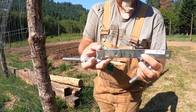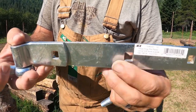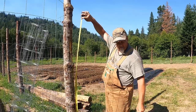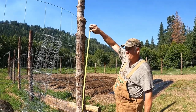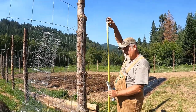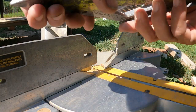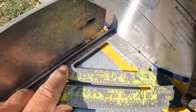The hinge has square holes for carriage bolts so we're going to bolt it through the wood. This fencing is six and a half foot tall — I want the gate to be pretty close to the ground and the same height, so I'm going to go six and a half foot tall. I'm going to need three ten-foot two-by-fours and three seven-foot two-by-fours. Make sure to square your saw before you start cutting — nice and flat against the backrest and square against the blade.